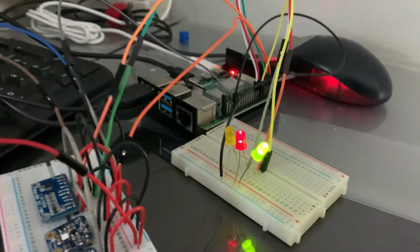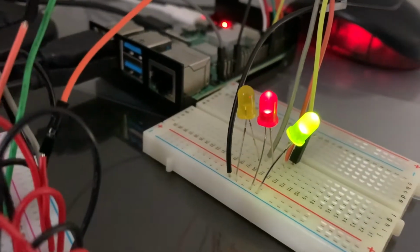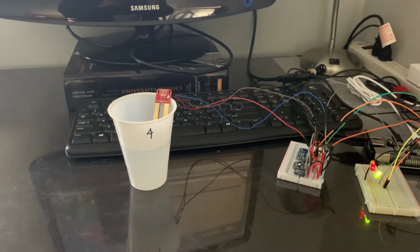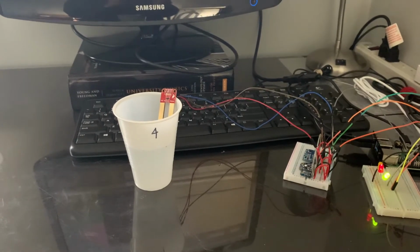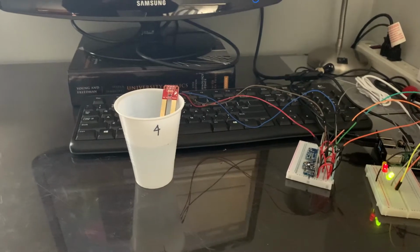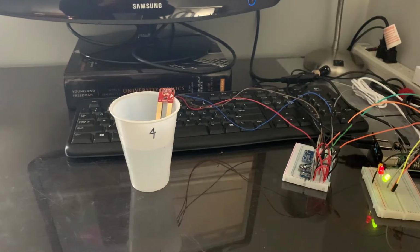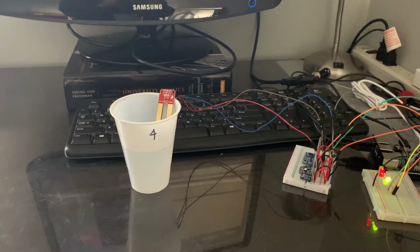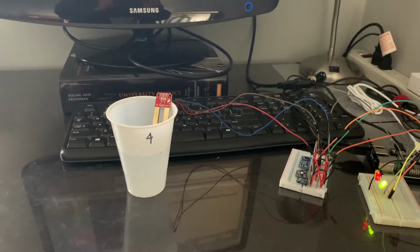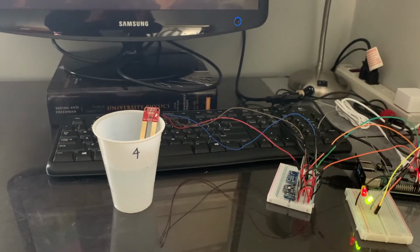These are also observed in our physical hardware with the following 2 LEDs, the red and the green, turned on. It should be noted that the calibration values for relative humidity and environmental air temperature were set to extreme values for the sake of demonstrating the functionality of the feature, and would actually be changed to appropriate values that would be optimal for plant growth health.